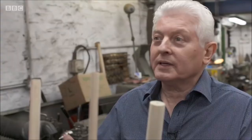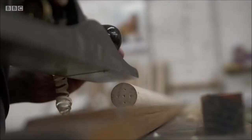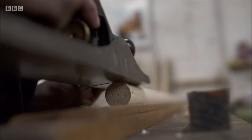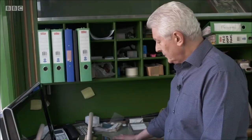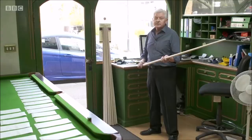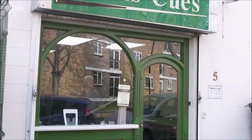We'll leave the squares for a couple of months, then take it down to an oversize and leave that for at least a month. From there we take it down again to the midsize, leave it again, and then to an oversized finish. We then weigh the shaft to check the weight, because there can be quite a variation due to the densities of wood. Then I'll check it over and decide on the grain and how rigid it is, depending on what length the cue is going to be.